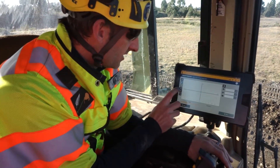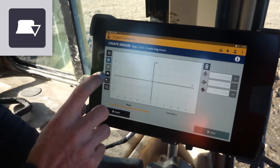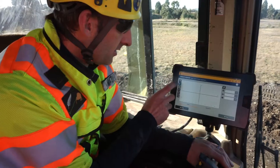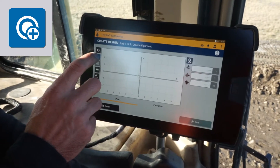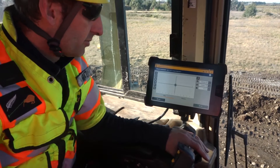I need to check here that I've got the correct focus tip selected. It is correct - it's the right focus tip on the blade; the right tip of the blade is what I'm going to use to pick up the stones. I'm ready to add a point with this button here that's highlighted in blue - and there's my first point added. Now I'll move the dozer and we'll pick up the second point.